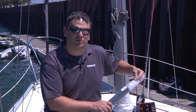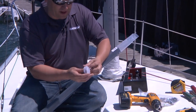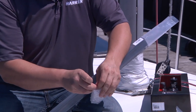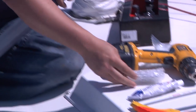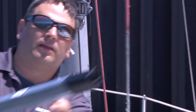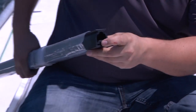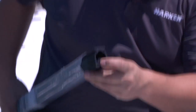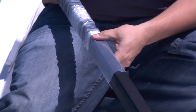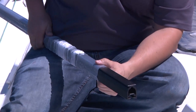With the traveler track comes a set of bolt slides. These bolt slides are essentially large flat washers that slide into the track profile and allow us to use any hole spacing in the back. The track itself has a unique shape that allows for that — it captures the head and gives a nice clean look at the top because there are no fastener holes to leak water through, and it allows us to use that existing hole spacing.